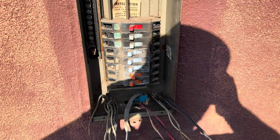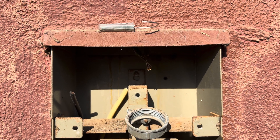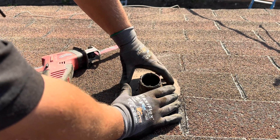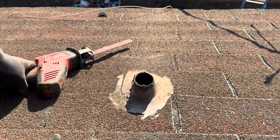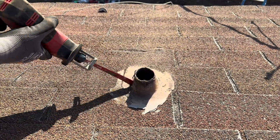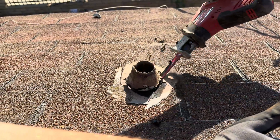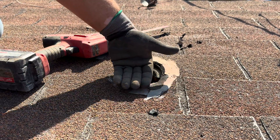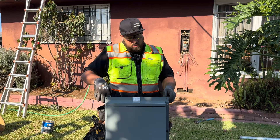After you get all the wires labeled, cut loose the main feeders going up and yank them out to get the weather head out of there. We need to put a new roof jack up and install a two-inch riser instead of the inch-and-a-quarter that was there before. To remove the old one, I cut down the side and then go in a circle, get it off, and then we'll slide our new flashing underneath the shingles.